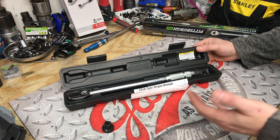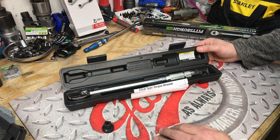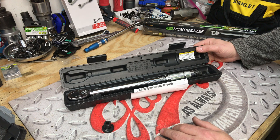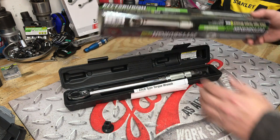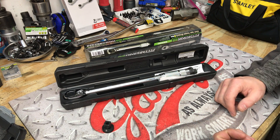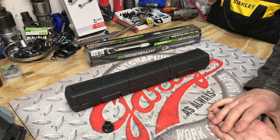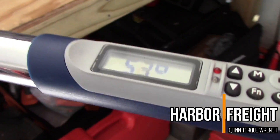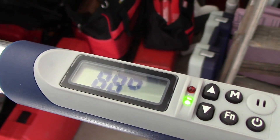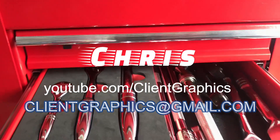At the end of the day, that torque wrench survived lots of drops, lots of abuse, lots of over-torquing up to 146-148 foot-pounds — almost double the 80 foot-pound spec. Both of those myths are pretty much busted. You may want to get it calibrated if you drop it, but as you can see, it really didn't fall too far out of calibration. We're not going to the moon — just torquing things around the house or working on the car. I'd say it's good to go. Harbor Freight has a lifetime warranty on that Pittsburgh Pro torque wrench that you may not ever need. Work smarter, not harder, and we'll catch you in the next video.